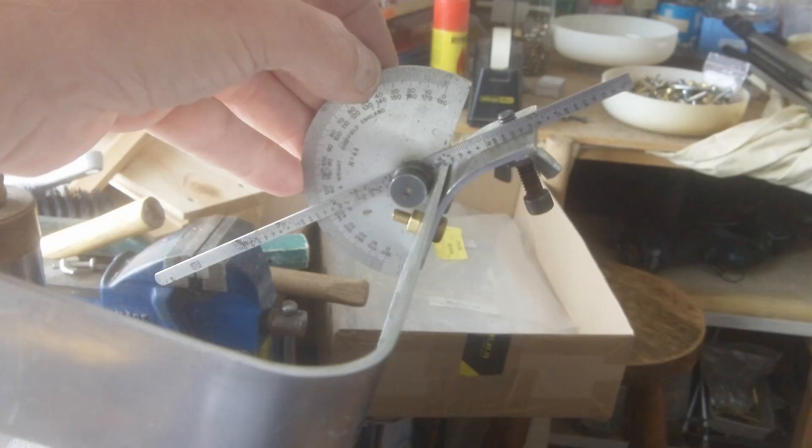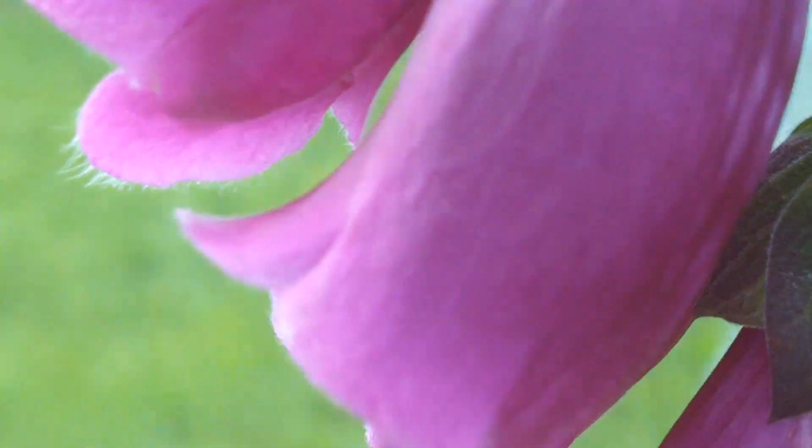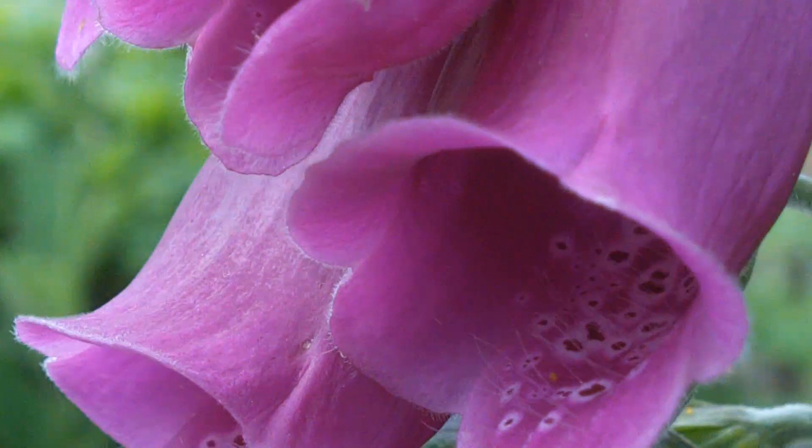In order to get the correct focal length of 5¾ inches from my camera to the next axis point, I needed a 44-degree angle on that little bracket. I worked that out by trial and error — I could have done it on AutoCAD but it was easy just to bend it and try it, and I measured it once I'd got the angle right. Anyway, I think that gives you some idea of how I went about making it.